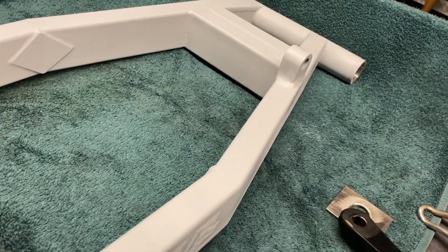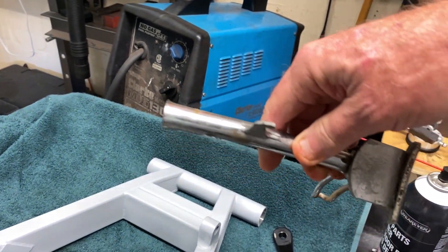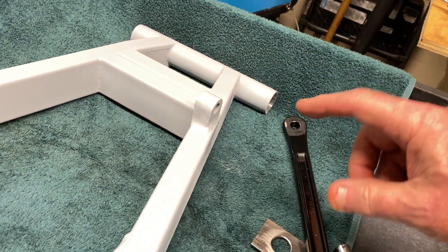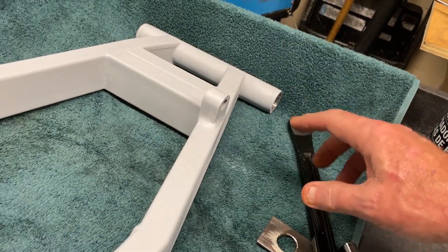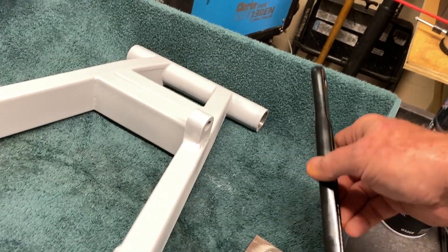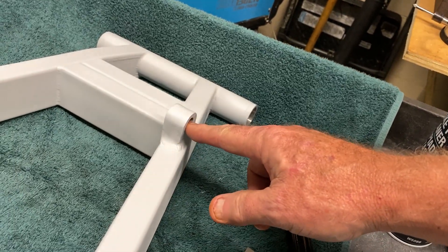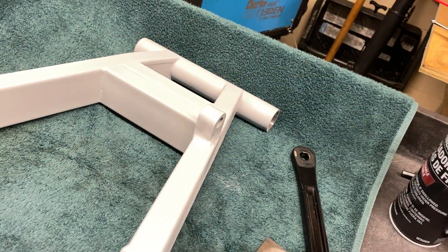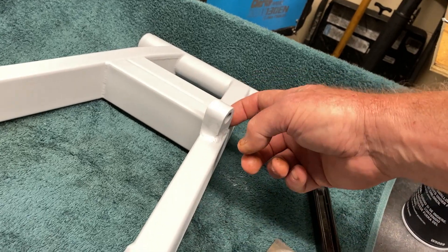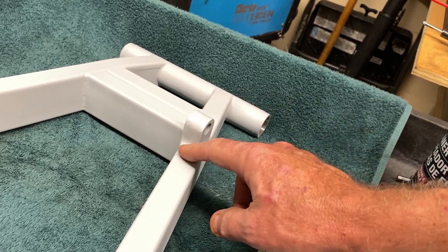That's why this thing is so beefy. What I made that out of was the bottom of a kickstand — that slotted section of a kickstand — which has got the M8 thread on the inside, and it takes the bolt for this perfectly. There's no bolt modification necessary. It's got the thread on the inside here, and it's a shank bolt, so it just goes right through this hole, and that hole keeps everything aligned, and then tightens up via the thread on the back side. I put a spacer between it, welded the spacer in, and then welded all around the sides to kind of fill that in. Then I did some of that JB Weld filler as well.